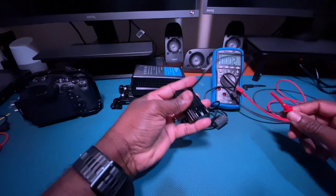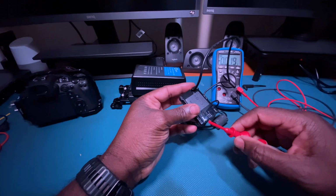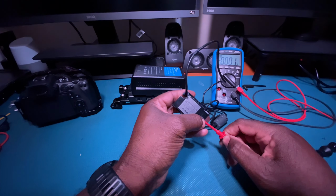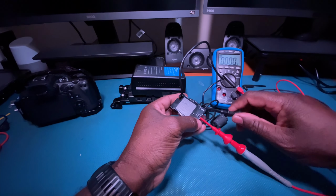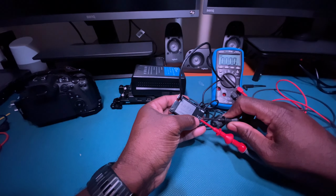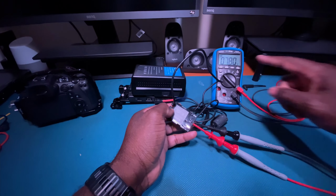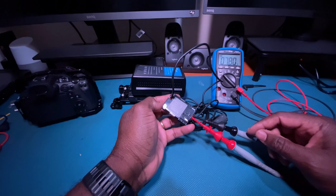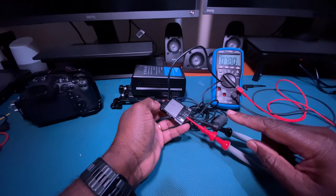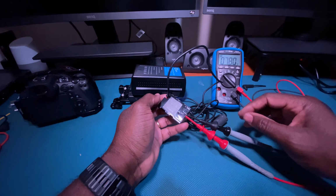It's been fed into the Canon adapter, so the Canon coupler. Positive is red, so I'm going to try and connect that to here. Is it in there? It looks like it. Good. And negative in here. These things are notorious. Oh, brilliant! I got it right almost quickly. So you can see the voltage coming from the battery into the Canon dummy battery via the V mount is 7.80 volts. So it looks as if things are correct.